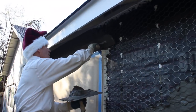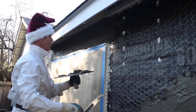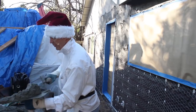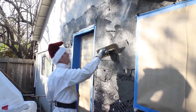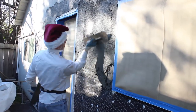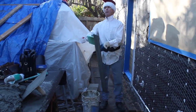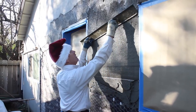I switched back to my silver surfer surfboard trowel. Why am I using such a gigantic trowel? Because I can and I like them. What I did here is put it on pretty thick to feather back down. If you're good with your tools you can use a large trowel like a Darby or a rod, but if you're not, use a Darby straight edge — wet it, always wet your tools on both sides — and you can use that to get a true wall.